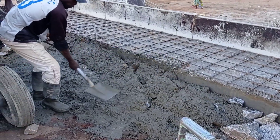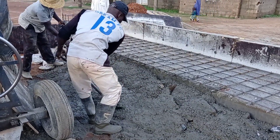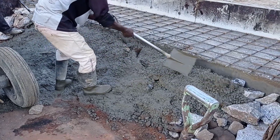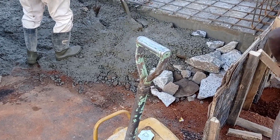After placing these boulders — or you can see the hardcore — we are pouring concrete into the decking as well as to this slope. We have used a mix ratio of 1 to 4 throughout.